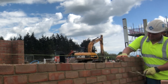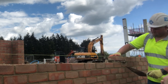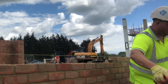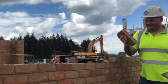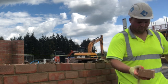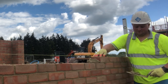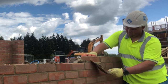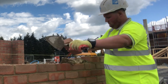Once you've got yourself loaded out and inducted, when you're first starting a new job I tend to get half a tub. A lot of the time I can easily use a full tub on my own in the morning, so it's not an issue about it going off — especially in winter. But in summer you want to get half a tub at once because it goes off pretty quick, and if you're on a new site with a new type of brick it might take you a little bit longer. You always want a pack of bricks on your loading bay — more gear than you actually need right then — so you've always got something to fall back on if there's a delay with mortar.